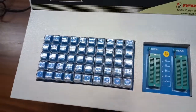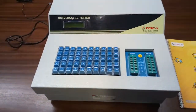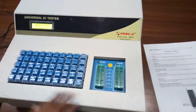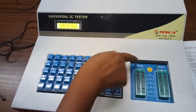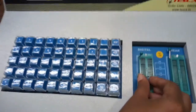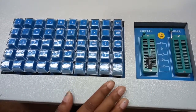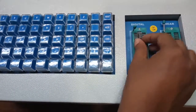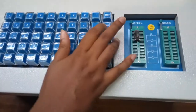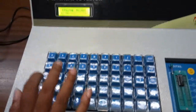This is not for users. The user manual is given with the kit. To test the IC, we need to put the ICs in the ZIF socket. First, pull the lever, put the IC at the bottom part — don't put it in the front part, because if we put it in the front part, it will show the IC as bad. We can verify this: with the IC placed in the front part, this is 7400, change to digital mode, and we can see it is showing fail.